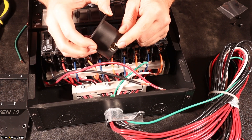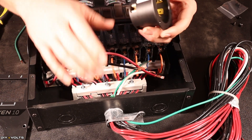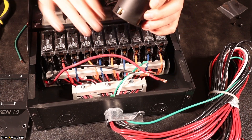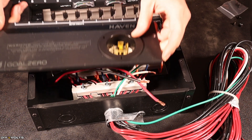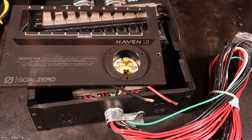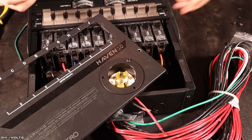Across from the ground is a silver screw for the neutral, which is the white wire. There are also two other wires — a red and a black — which go into the gold-colored screws to bring in the hot power. Before installing any wires, remember to take the front plate and get it connected, using the included screws to mount it into the front plate. If you forget this step first, you won't be able to get the wires through the front cover — so don't forget the cover first.